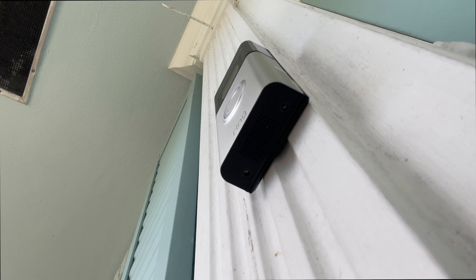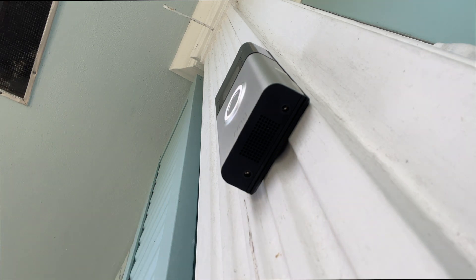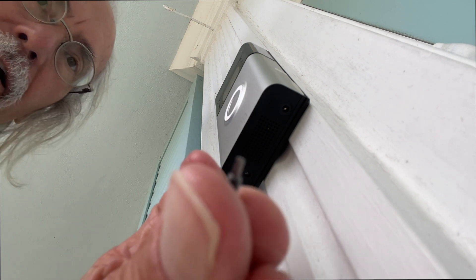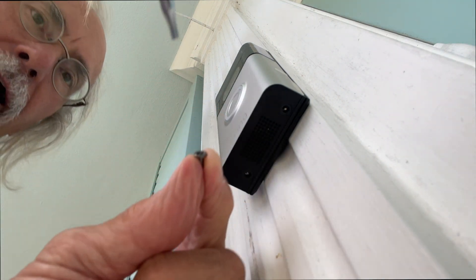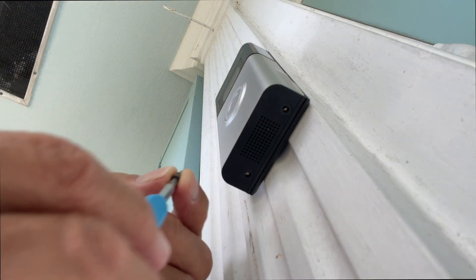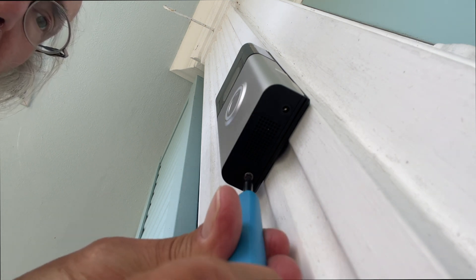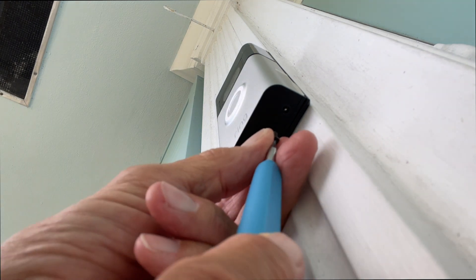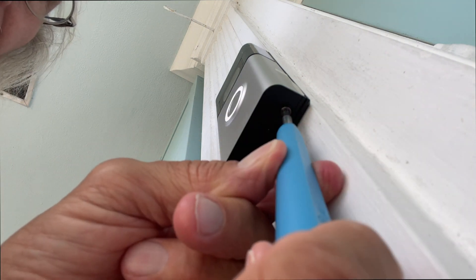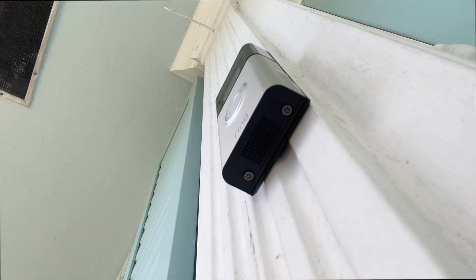First of all, you have to have this tool that came with the Ring doorbell. You're going to take one of these security screws — you've got to screw that in with this star device. Come under here, shove that in there like that, find the hole, push it in, and turn it clockwise — righty-tighty, lefty-loosey. Put it right in there, come up under, find that little hole, push it in, and go to the right just like that. It can be tricky with your fingers in the way. Now if I pull on it — bam — it ain't coming off.